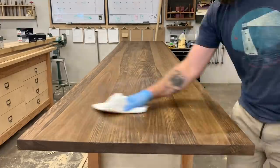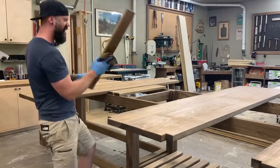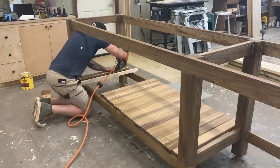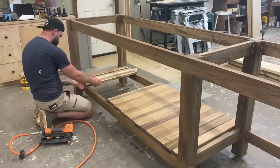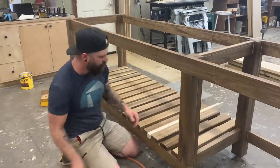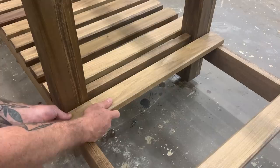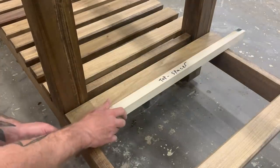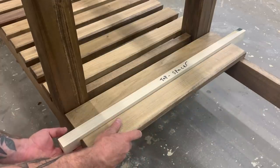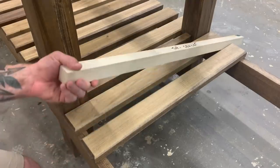The way I do this is I just wipe it on with a rag — because it's Wipe-On Poly. Let it sit, sand with about 500 to 600 grit sandpaper, then wipe it again, let it sit, sand it again, and then finally wipe it one more time. With everything stained and finished, I started installing my slats. I saved this to last because there was no way I wanted to try and stain and finish those slats in place. Now, some of you might cringe watching me nail them in place with a 16-gauge nailer, but this is where you have to really know your client. This is a display unit going in a retail store. I could have spent time doing some hidden fasteners or through dowels, but to be honest, they just weren't paying me enough money to do that sort of thing. So I just used a little pre-cut spacer and tacked them in place — and honestly you couldn't really even see the nails.